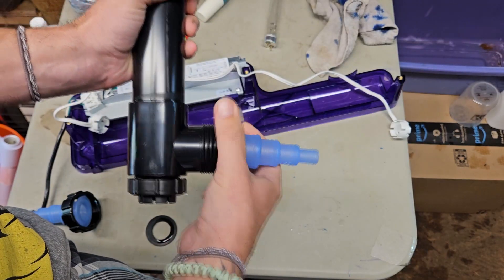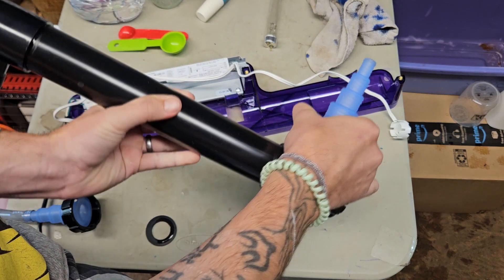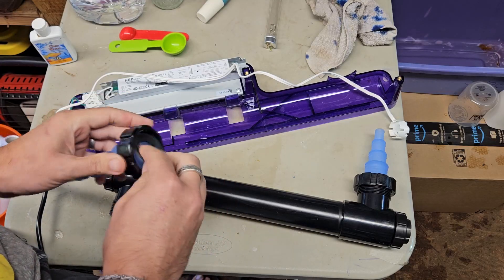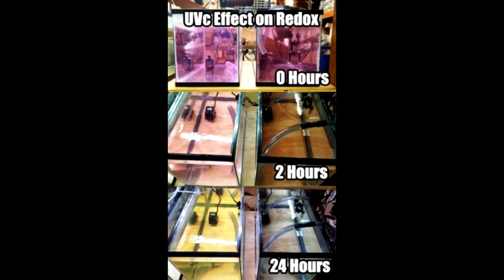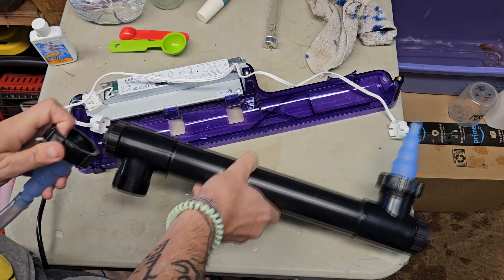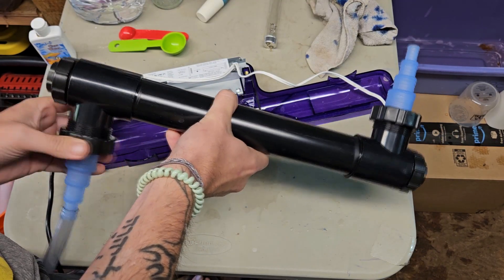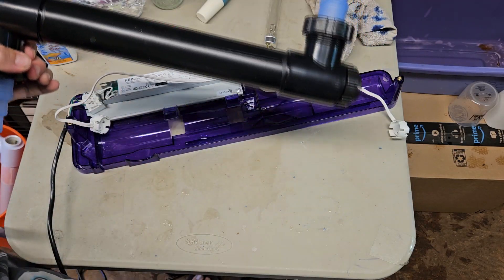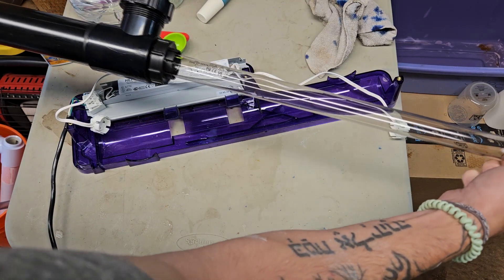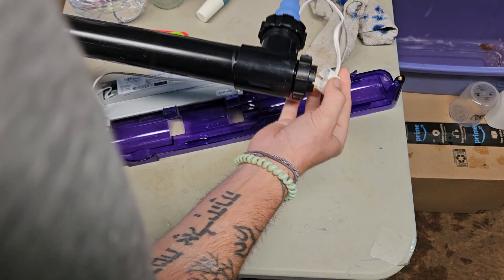The tests we put in place were simple ones we've done in the past. We took a TMC Vecton and a TMC Titan UV sterilizer, applied an oxidizer, and measured the color and millivolt effect. We also had plain water as a control and an oxidizer as a control. Our bias is that when oxidizers are applied and there's an increase to the millivolt in the water, the UV will reduce the oxidizers to a maintained state, helping maintain the millivolt reading. The water control should maintain a millivolt reading over 24 hours, and the oxidizer control should hold a high millivolt reading then decrease.